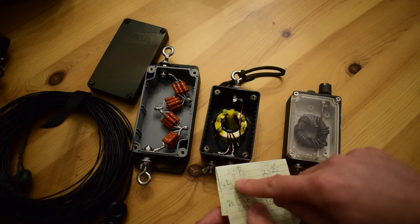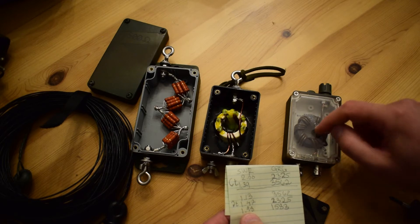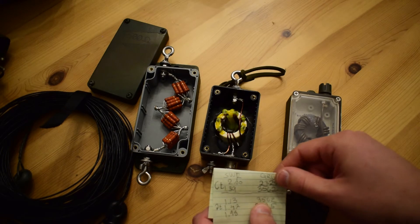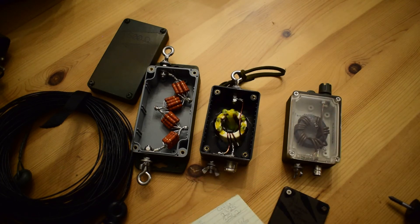At 2.325 MHz, the seven-turn version has an SWR of only 1.47 — perfectly usable where the six-turn version hits 2.0. On the 80 meter band, the seven-turn version has an SWR of 1.13 through the 500 ohm resistor, which is a pretty good match. So if you've seen my earlier video recommending six turns for HF, I now recommend seven turns instead — I got an SWR of 1.98 at below 1.6 MHz, meaning I can cover the full spectrum from 1.6 MHz up to about 7 MHz.